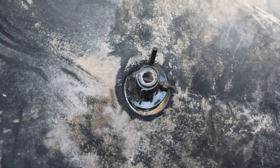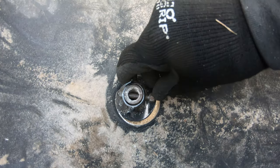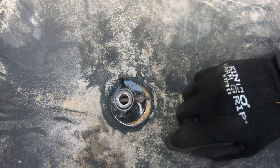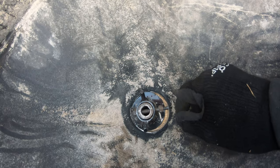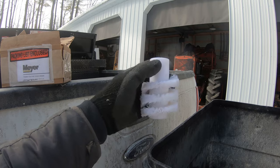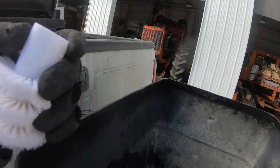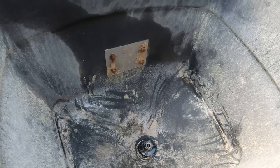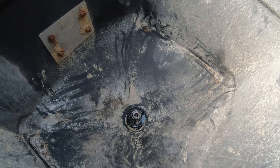One of the things we're working on today is replacing this auger. It's a stainless steel auger, but as you can see it's made for really coarse material, whereas what I'm using is a fine salt and sometimes a sand mix. So I went to Myers and got this brush — it was highly recommended for the kind of material I want to spread. We're going to put that in there, put some never-seize on it, and I'm also just going to loosen a couple of these bolts and put some PB Blaster on them so if I ever need to take this hopper off for maintenance, we won't have an issue.